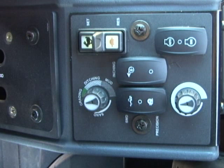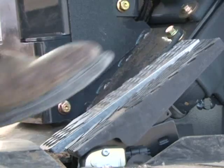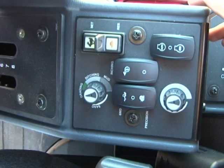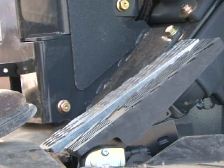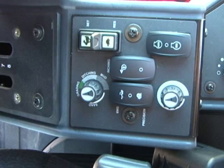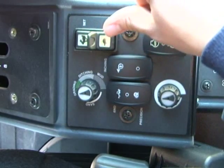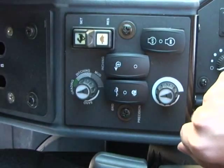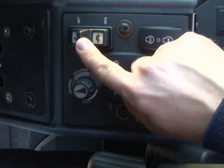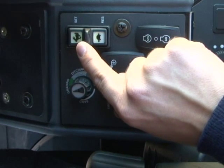Behind the transmission lever are the engine speed control and the six wheel drive controls if equipped. The engine speed control is similar in general to cruise control in your car and has two modes: automatic and manual. In automatic mode, you use the accelerator pedal to set your engine speed; the speed is set by moving the switch forward or rearward, and that RPM will be maintained when you release the accelerator. Once set, the speed can be adjusted by bumping the toggle forward for faster or rearward for slower — each bump changes the speed by 50 RPM. Holding the button in either direction for more than 2 seconds will ramp the speed until released or the RPM limits are reached.